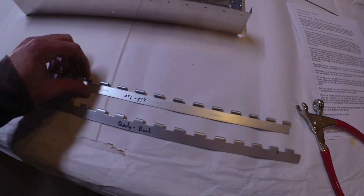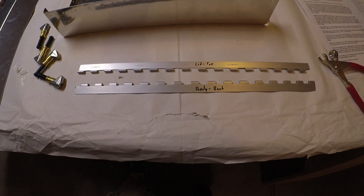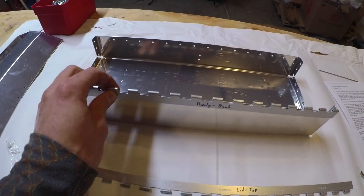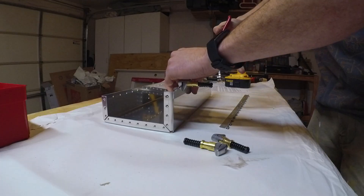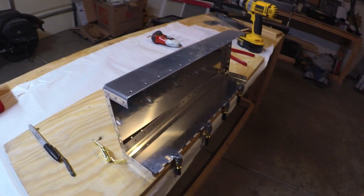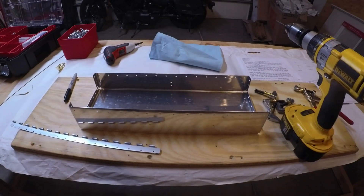We're going to go ahead and get the hinge set up. I've already measured the different segments of the hinge, got some marks there, and I'm just going to cut those to length. Hinges are cut to length now. We'll be attaching the piece that attaches to the body, put some clamps on that, and match drill to match those holes. We'll repeat the deburring process on both of those pieces. I went through and marked them all with a sharpie, so I'm going to take the hinge off and run it over to the drill press. That looks pretty good. Now I'm going to go through and open up all of these holes to the appropriate size, and then we'll get to the dimpling and deburring.